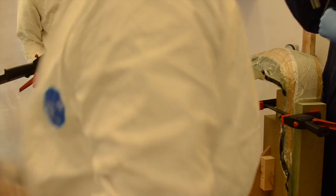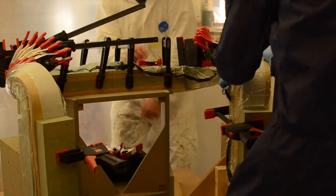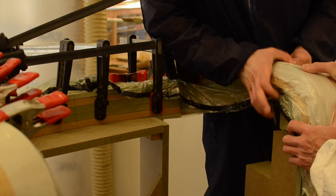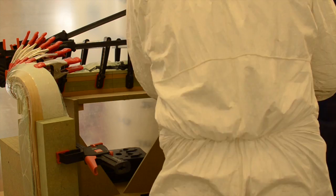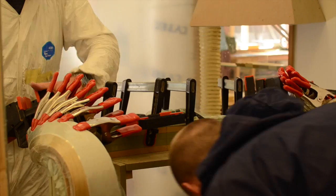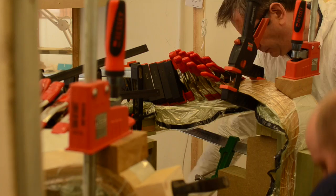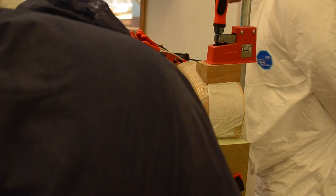As you can see, we needed lots of people on this job and also lots of cramps. The veneers are being pulled together by the vacuum bag, and these cramps are just to pinch in certain areas that might be a bit loose where the layers aren't quite being pulled together. They're also there to make sure that the bend is quite symmetrical — if you look down a center line it's symmetrical — and that it's pulled down at those key datum points.